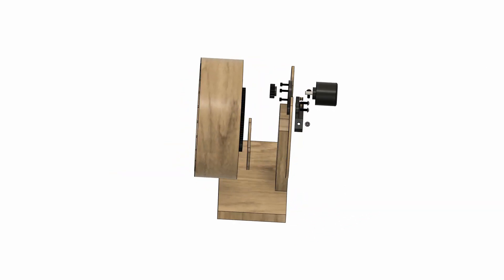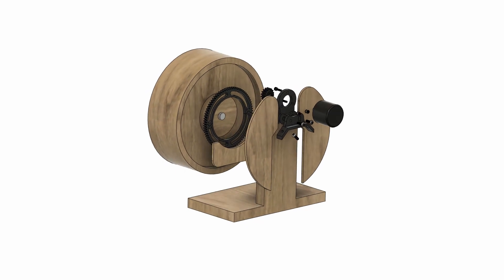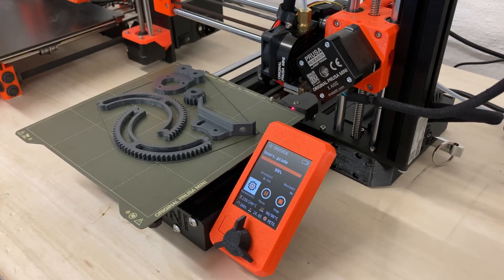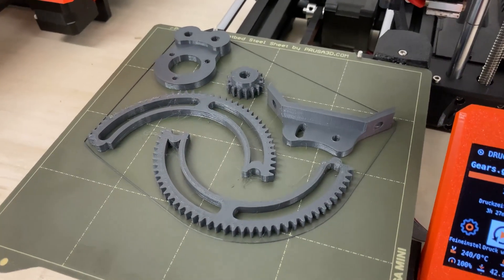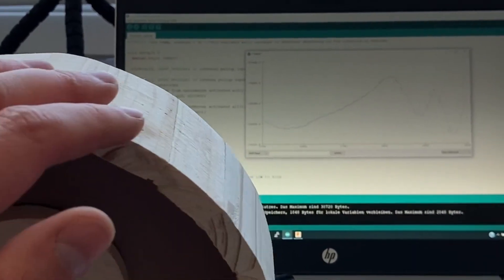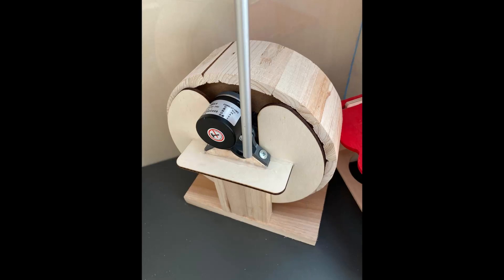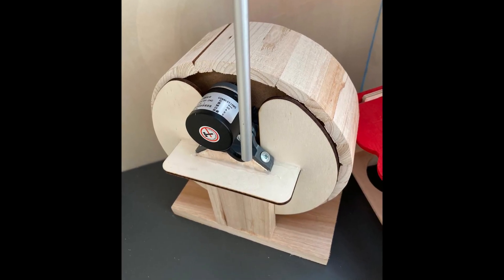After solving the trading trigger issue, our next task was to figure out a reliable mechanism to track wheel movements precisely. Our plan was to stick with his existing wheel and add all the components needed without exposing Mr. Gox to any risk. An industrial-grade rotary encoder, which is a small device sending electrical pulses when being rotated, attached to some gear mechanism gave us the chance to do so. As with the tunnels, all mechanical parts were 3D printed and covers were laser cut from wood.